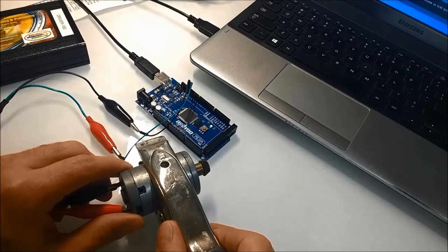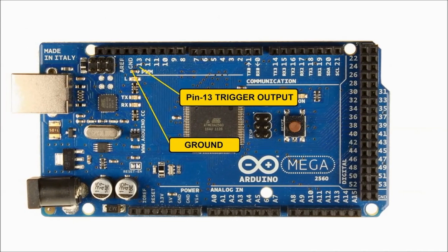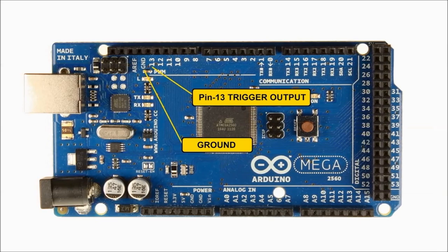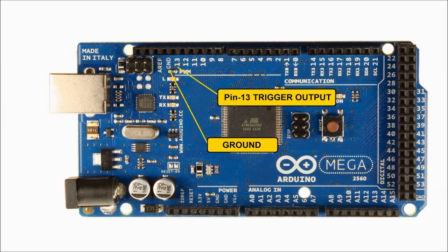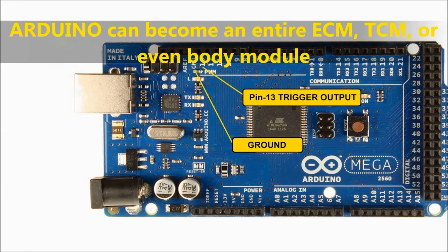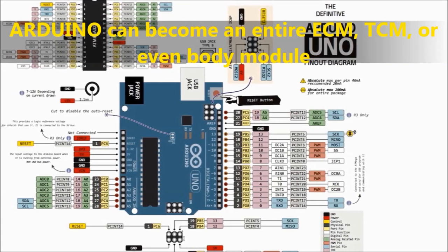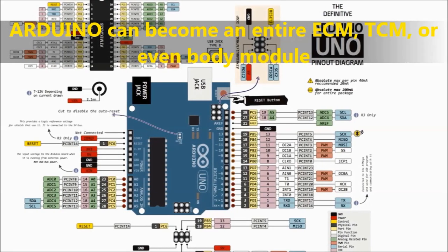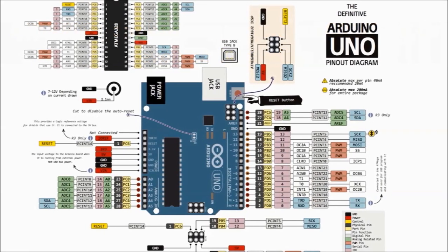we can make it react to other things. We're going to see that in other videos in the future. In other words, we can make it react to a specific instance. For case in point, engine temperature, and we can tell it in software, like we're doing right now, when the engine reaches X amount, say 200 degrees, turn the fan on full, in which case we'll mess around with the delay and make the motor stay on longer or less, depending. So if the temperature goes down, then we tweak it so that it reacts to a lower temperature. It's not easy, but the concept is pretty simple.